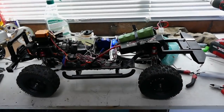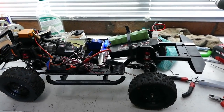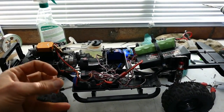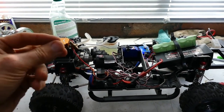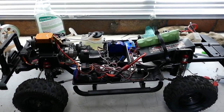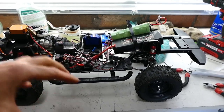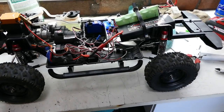I managed to pull apart the transmission just to check that everything was intact and there were no issues with it. Everything looked okay. Basically, I took out the internal clutch — the one that shifts it from first to second — pulled the little grub screw out, there's a little spring in there with a check ball. Pulled that back in and just put it all back together. And so far it seems to work. There's been so much interest in this project that I wanted to show you it shifting gears.